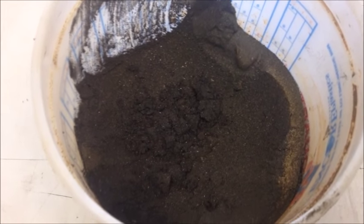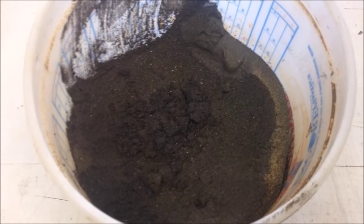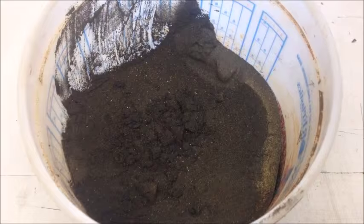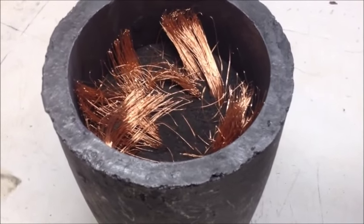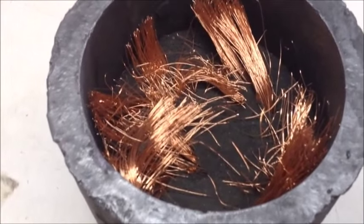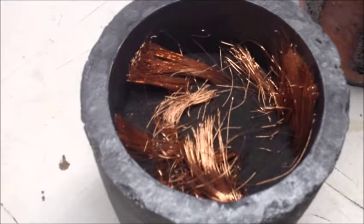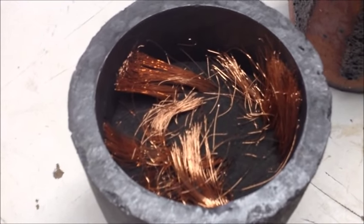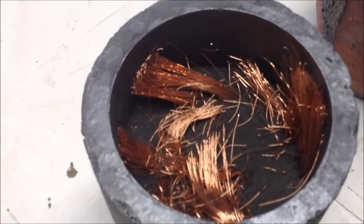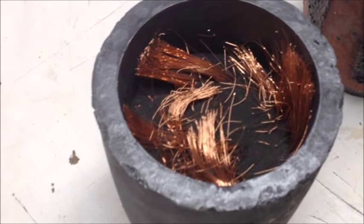So I'm going to try and force it into a mat phase through the first smelt, and then after the first smelt I'm going to take the mat and reprocess it using potassium nitrate, which is a very extreme oxidizer, and some iron filings so I can avoid the roast. I took one cup of the high grade number one and number two and mixed it with two and a half cups of Chapman flux, and I added about a pound of fine copper wire to the mix as a collector metal. Without enough metal in the charge, when you pour your material into your conical mold you don't get any button at the bottom — it all stays suspended in the slag. You need a collector metal to filter down through the material and capture the gold and other precious metals like silver, and bring it down to the bottom in a button — or what actually turns out to be a little pyramid. So I use copper.